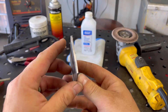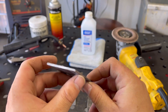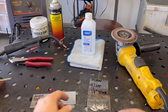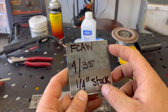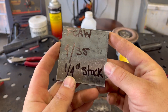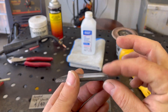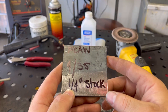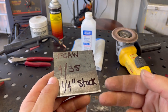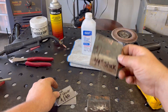For gas metal arc welding (GMAW) on eighth-inch stock — the maximum for that process on this machine — I set the welder to number four and wire speed to 40. For flux core (FCAW), which we're doing now, I also set it to number four — the highest setting — and wire speed to 35 for 3/16 stock. If we were welding quarter-inch stock, which is the maximum output for this welder, we'd bump wire speed up to 50 because we need more wire to fill that joint. When you go to heavier stock, you bump up wire speed to fill the puddle.